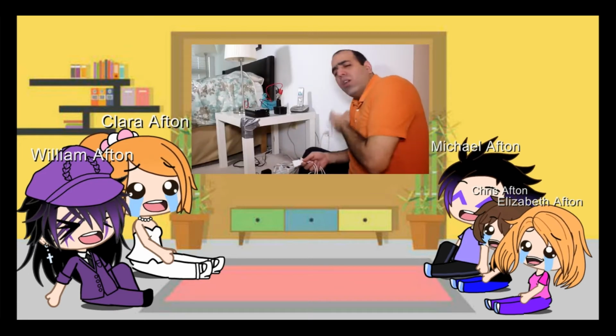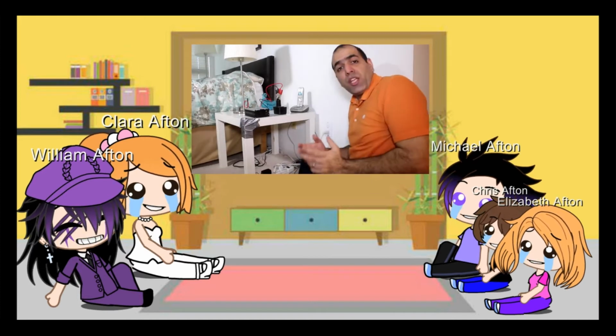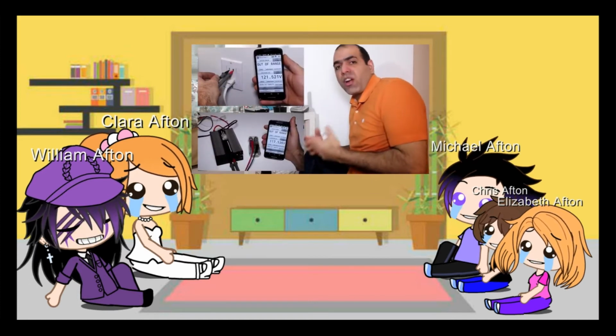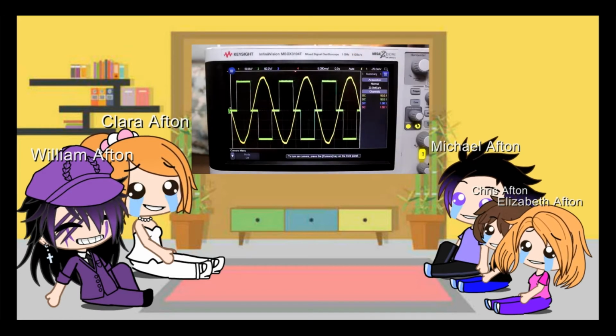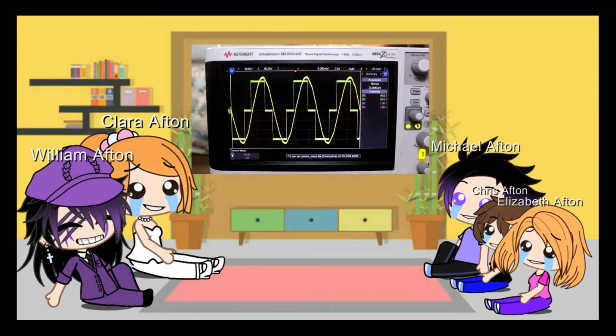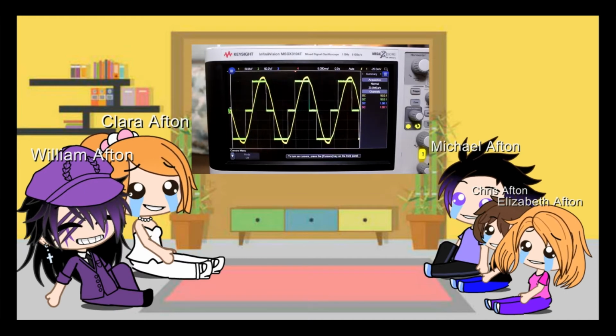Yes, we have to make sure our load is not powered from a different source, like the city power. The issue is that although both these sources are 120 volt AC, they are different in many ways. The yellow sine wave is the city voltage and the green wave is the output of the inverter. You can see that they don't have the same shape, they are not in phase or even have the same frequency, so connecting them together shorts their voltages badly.